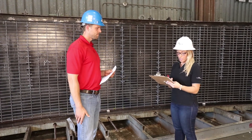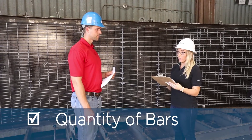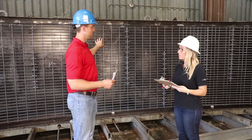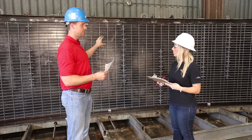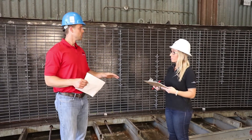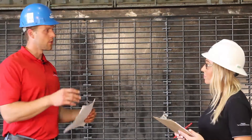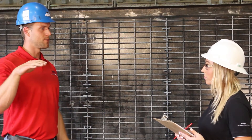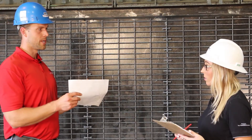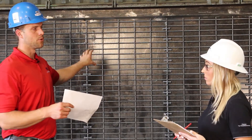Next on our checklist is verifying the number of welded wire reinforcing sheets in the assembly. We have a single layer on, and there are seven pieces total for this product — three behind us and four on the floor. Most of the time, our QC will check that steel right when it comes off the truck, so we don't have all the steel on the product and then have to take it back down and hold production. We count our number of mesh sheets right when they come off the truck before we get the mold set up.